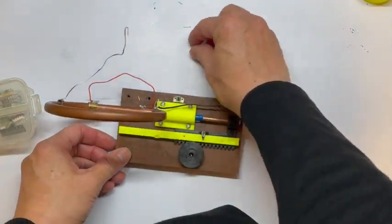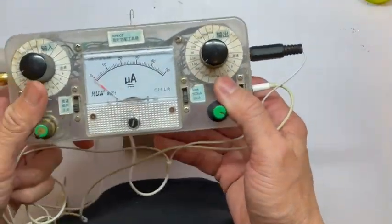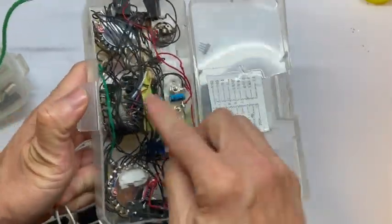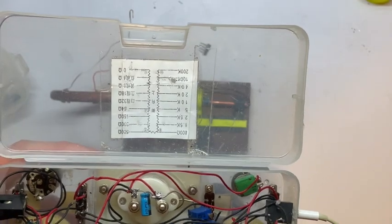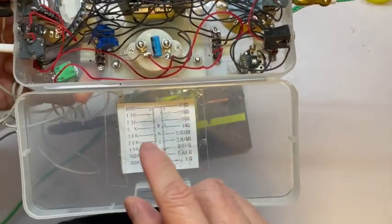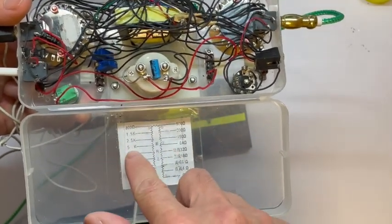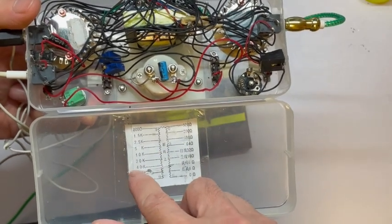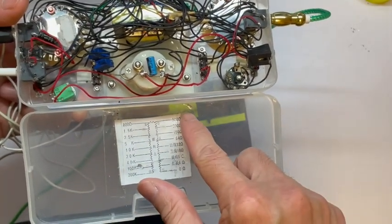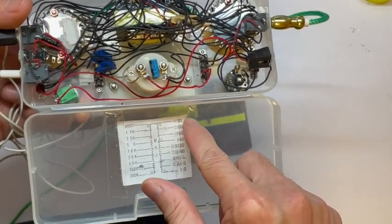Now let me start the testing. When I am testing, I will be using this impedance matching box. There is no amplification at all — no battery inside, just this transformer. I have introduced this transformer to you before. It is called KBP02. It can allow you to tune to any impedance. On the input, depending on the requirement of the detector, for the HSMS 2850 I will use 40K as the input impedance. And then the output impedance I connect to the headphone will be matched to the impedance of your headphone. I am using a 500 ohm headphone.